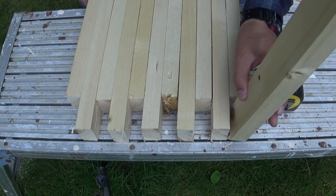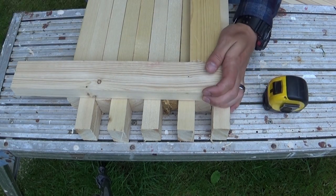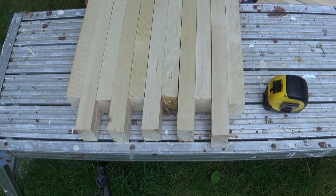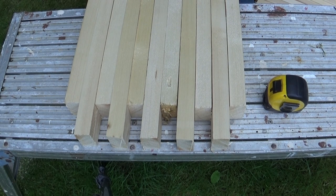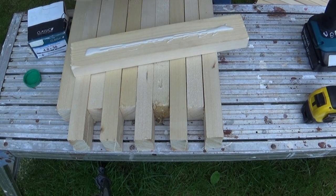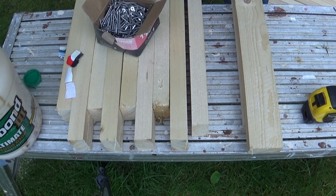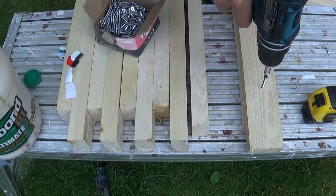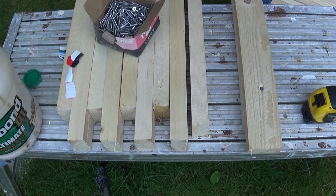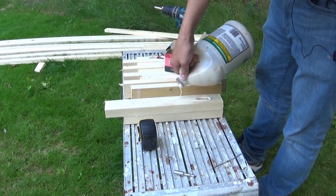To fit it together, your 1100mm pieces will sit on top of the 340mm legs. There's no right or wrong amount — it's what you want. I went for about 440mm wide and it feels stable. To put the legs together, put glue on the face and stick the next one down. If you don't have clamps, screw through the face — that creates almost another clamp. Even if you do have clamps, I'd still recommend this screwing technique as it adds another layer of strength. Stainless steel screws won't corrode or cause problems, and it reduces movement while clamping.